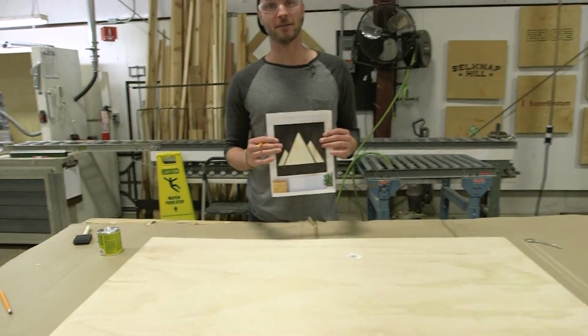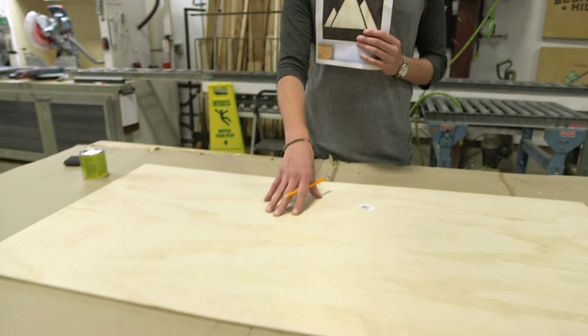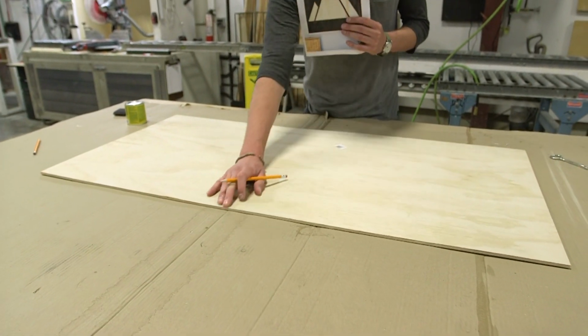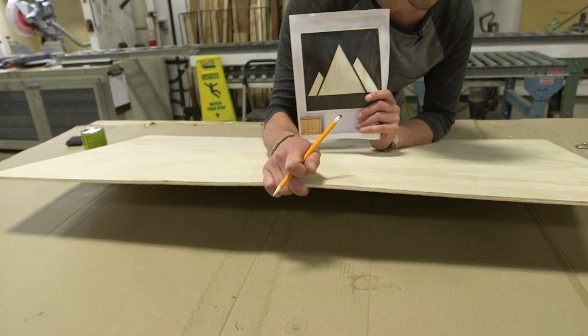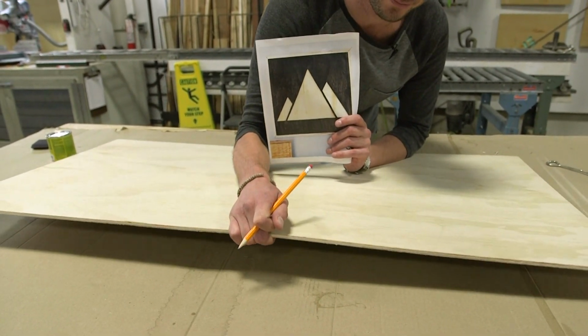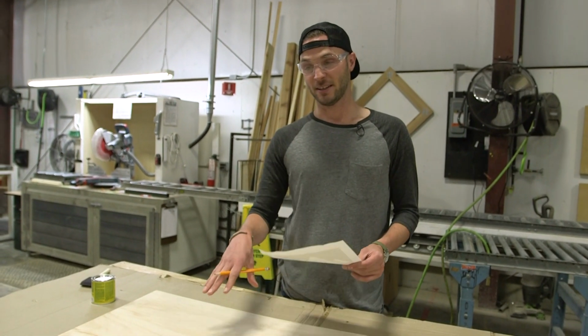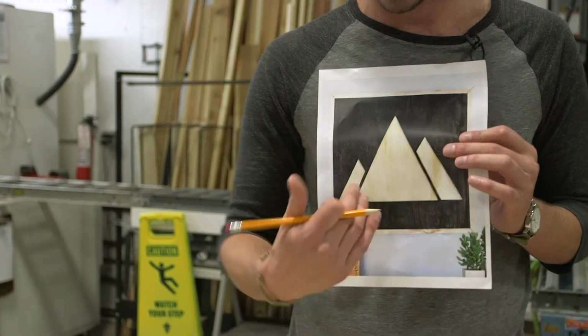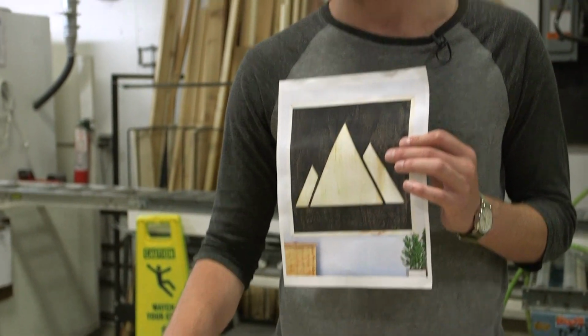We are making wood art today. So we're going to use this 2x4 sheet of Lauan plywood, which is 3-ply. It's very thin. It's not used for many things, but it's inexpensive and it takes a stain. So we're going to cut it in half, cut our shapes out, stain the background, cut these out, glue them in place, and then frame it together.